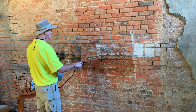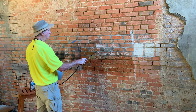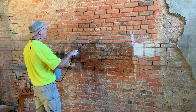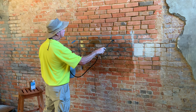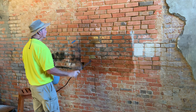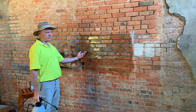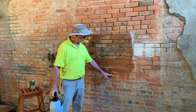We're going to do a wet-on-wet application. This is a silicone-based product, which is a water repellent, so it's still breathable — it's not going to trap moisture in the wall. Because it's a silicone, things don't like to stick to it, so it's really tough. It's not a film former, so it won't trap moisture. It may slightly darken the wall depending on the substrate.